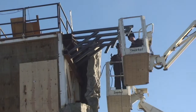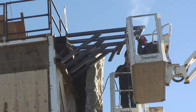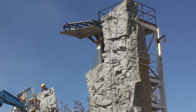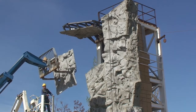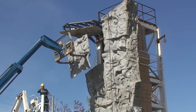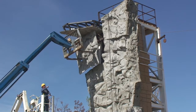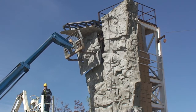Now we're welding the six-foot cantilever — it actually extends about eight or nine feet out from the rock. We're welding the support for that and then covering it with rock. In the next shot, the under-panel is bolted up and we're getting ready to hang the piece right below it to finish the face underneath that cantilever rock. I cut holes in the panel, put the panel through the forks, and put C-clamps on so it couldn't come off. We were about 32 feet up in the air — quite tricky — but we held it with the lift long enough to weld the angle iron out and bolt it through the face.